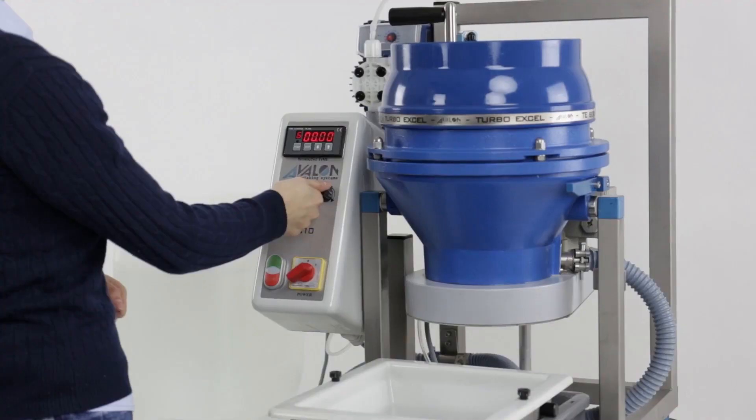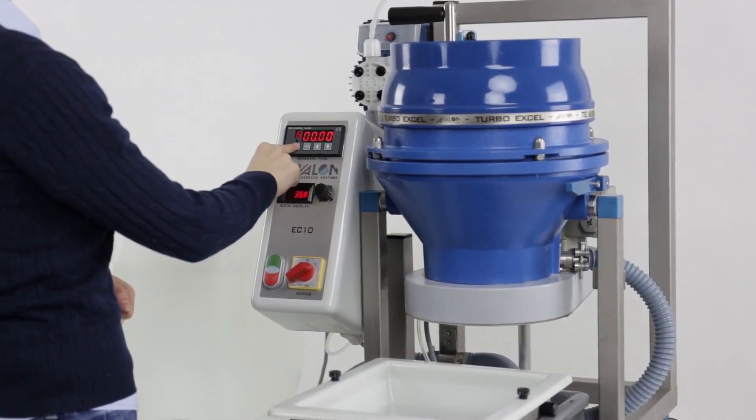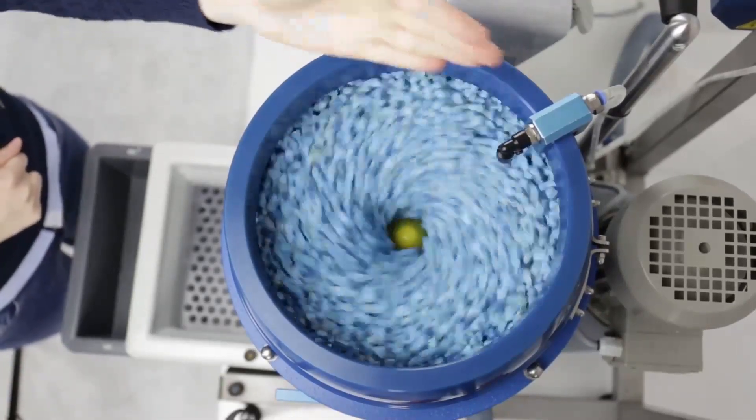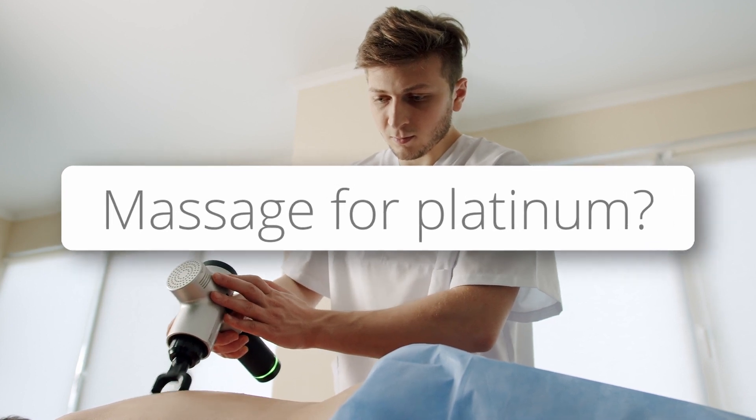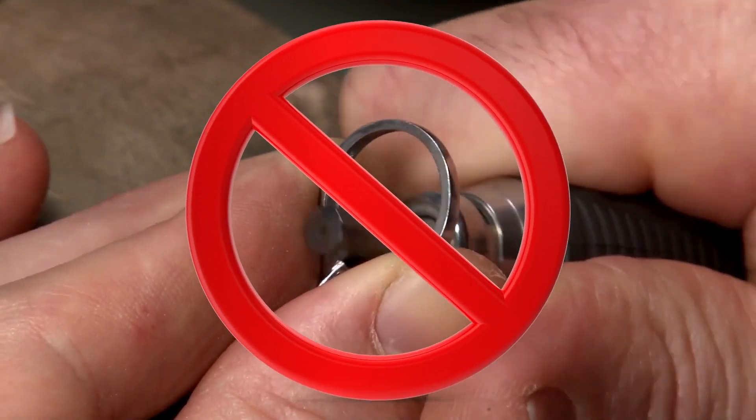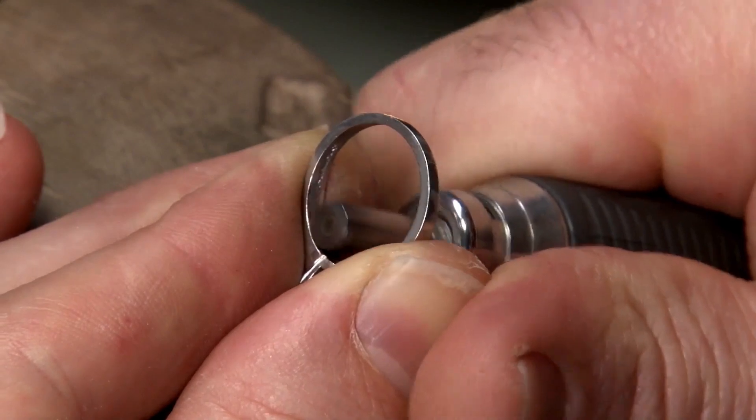Well, you have to distinguish between platinum burnishing and platinum polishing in a tumbler. When you're burnishing a platinum surface, you're essentially bombarding the surface and compacting it, making it harder. This increased hardness helps you get a nicer polish faster. It's really like an intense surface treatment, and that allows you to automate. Rather than having people with a hand burnisher spending a lot of time to densify the surface, you're using steel balls to hammer the platinum down a little bit and give it the hardness you need for the polishing process.